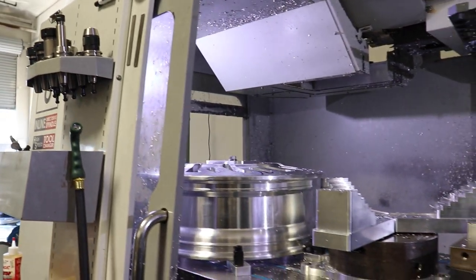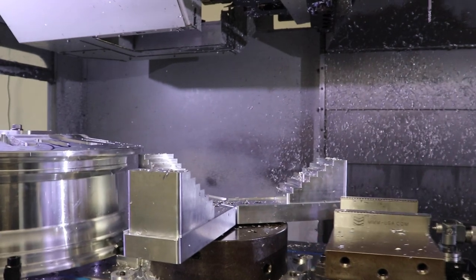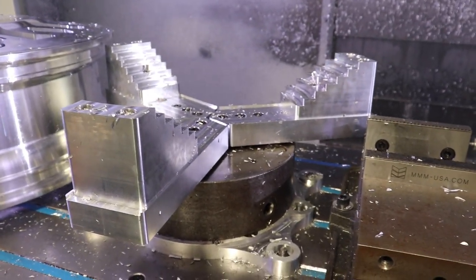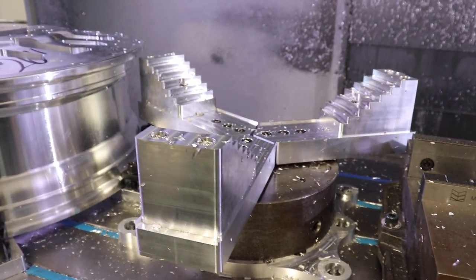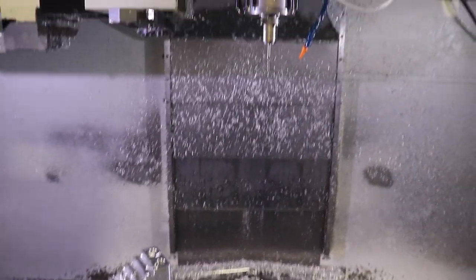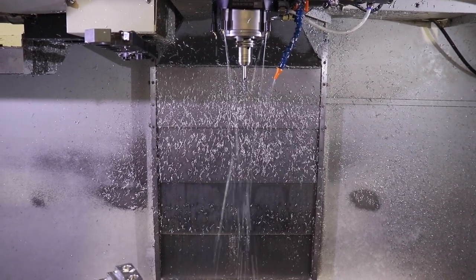These are some custom jaws we made just to hold the wheel — you have to hold the metal inside the machine without it flying away. Those are just custom made here. Some machines use coolant — you need that to cool down from the friction of cutting. When you're cutting, it generates a lot of heat. The coolant manages the heat, lubricates the cut since it's water and oil, and the really important part is it blows away the chips so your metal shavings aren't being nested in the same spot and you're not recutting chips — which is not good for tool life and messes up the wheel.